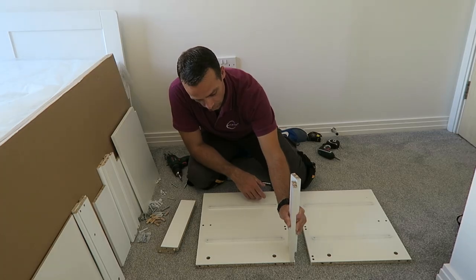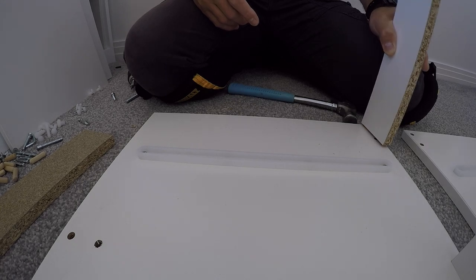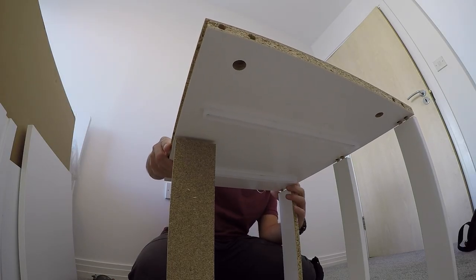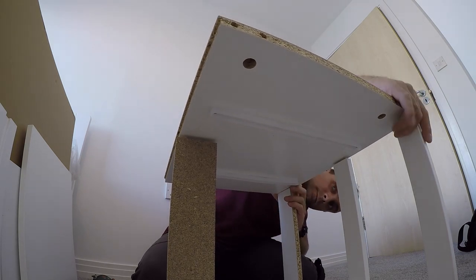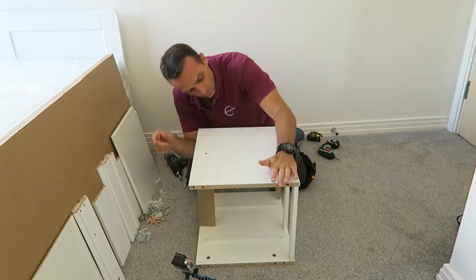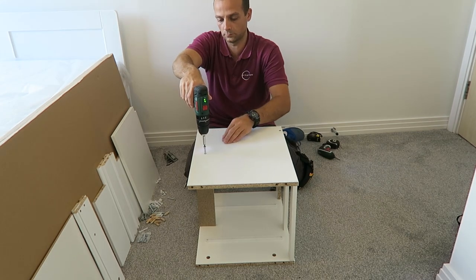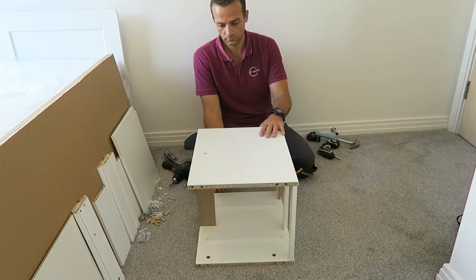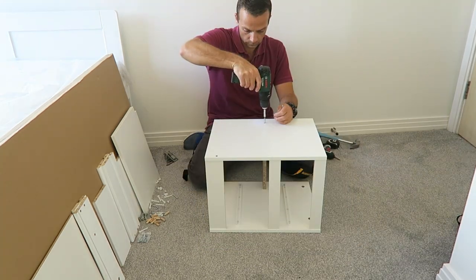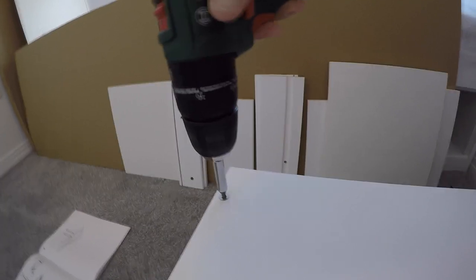Now we can place the front dividing panels — two of them on the top, one on the bottom which is the thicker one, and one at the back. The back one is without color. We can put the side panel in the top, the ending one — two side panels joining those four dividing panels. One screw through the bottom panel and the back panel, and one screw through the side panel to the dividing panel — that's the thicker ones. Turn the drawer the other way around and do exactly the same: one screw at the back and one screw at the bottom. Secure the screws and the frame is secured together.